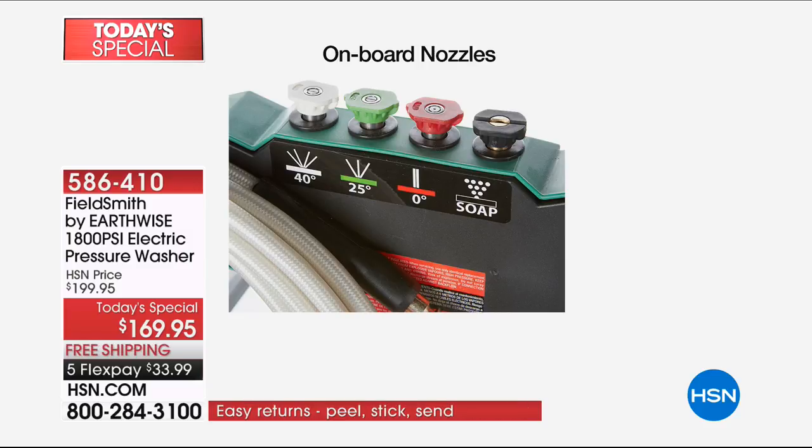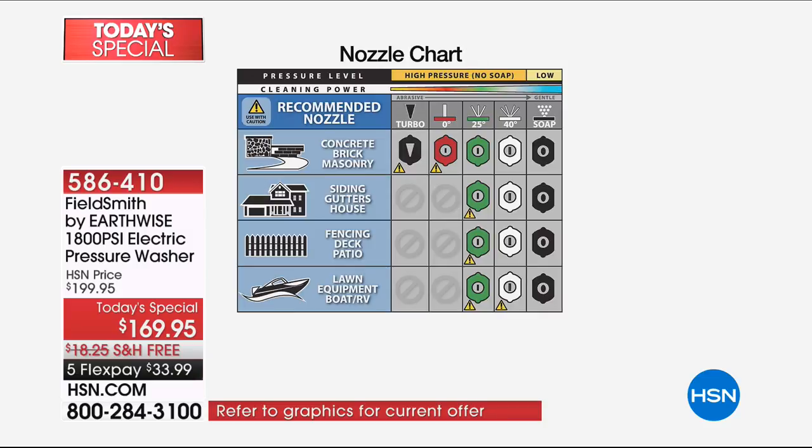Then you can see that red one, that's the 0 degree tip. That will reach 16 feet in the air. Wow. So second story, windows and screens, it's perfect. 25 degree was the one I was using. You're gonna use that all the time. 40 degree in the white, that's gonna be perfect for washing the car and other lighter duty jobs.